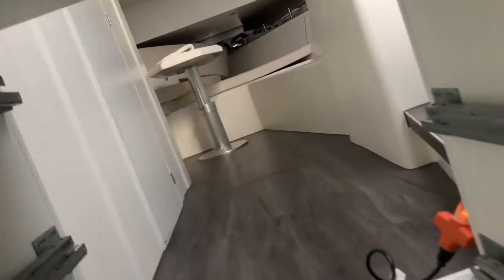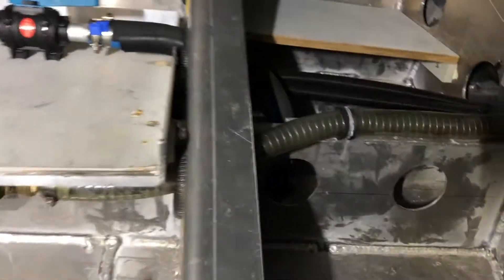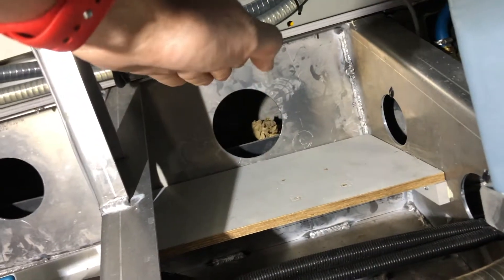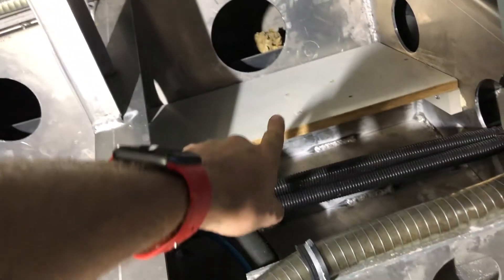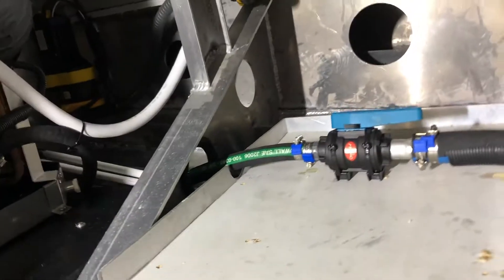There's one main difference, so we had to redo the installation. The old unit was mounted right here on this base. The intake was very high, coming up to about here, and this was just where the valve was. The strainer was even higher, and we had the pump mounted over here, so the pump was always running dry and burned out the pump.